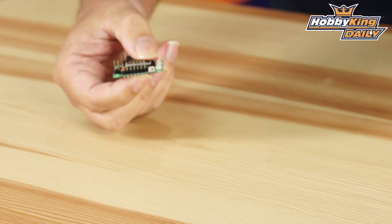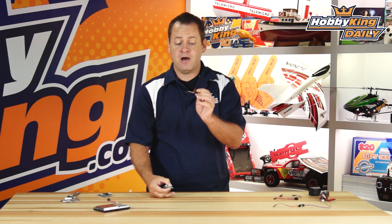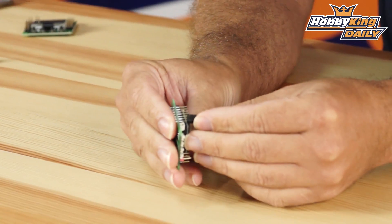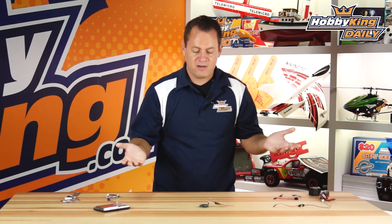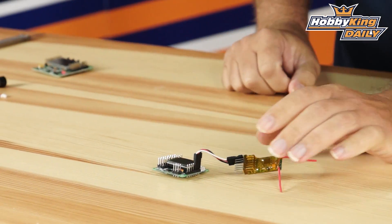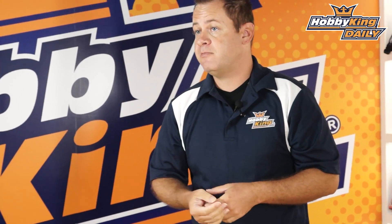What you would normally do is take a receiver — this is our Orange 615, which has PPM or CPPM output, which the KK can support. So I'm taking the single wire out of that, and since ground is there, I just go ground, positive, and signal right there. All our channels on one simple wire, plugged right in. The ESCs come in over here, so this is an uber clean setup for a small mini quad.